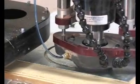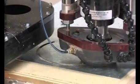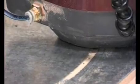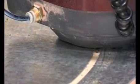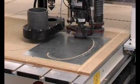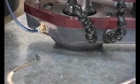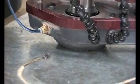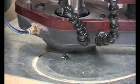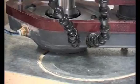The Axyz Ductmaker is also capable of cutting parts out of galvanized steel, making it a very attractive solution for all your requirements. The process is simple and easy, and it is identical to the cutting of the foam other than needing to use a different cutting tool. A dual misting unit is used to cool the cutter directly at the source of the cutting, ensuring longer-lasting tool life and a better cut-edge quality.